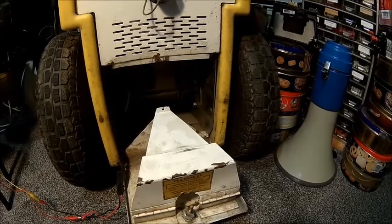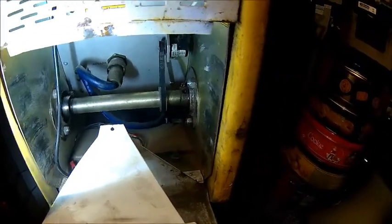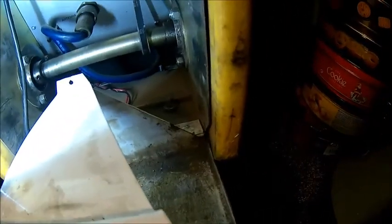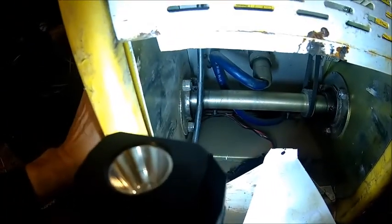It could be 24 volts, but it does not say anything. It's quite a tricky design. You've got a stop shaft which sticks on here, apparently held by some bolts — probably these allen screws here. I couldn't get the other stop shaft out. The center shaft needs to come out as well. There is a possibility that this is held with the encoder wheel here. I can't see any other bolt.